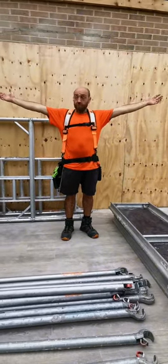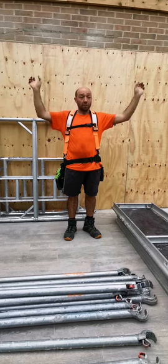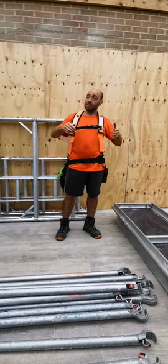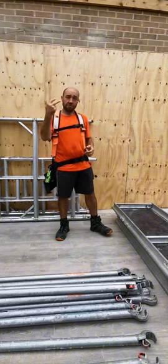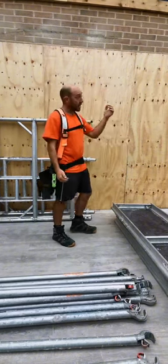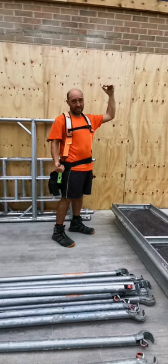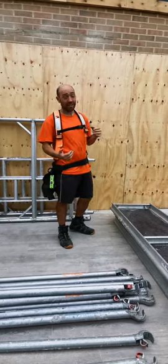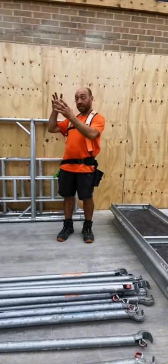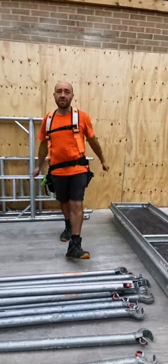How did I work this out? I've got my span of my build, finished plasterboard line. I know I've got 3 Veluxes, so I've deducted the 3 Veluxes by the span - there's 4 spaces and I've divided it up. Something to think about is how your lines come through your plasterboard. Is there anything going on the ceiling? Is there an island for a kitchen, are there units? Anything that can interfere - how does it work with your openings?